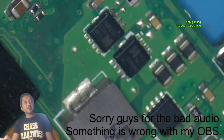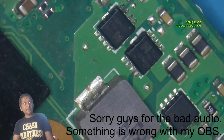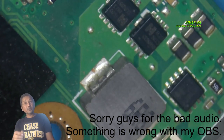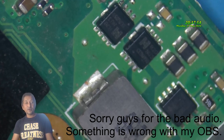They are also N-channel, and I checked, they are nearly similar. According to Sorin, we can use any one of the N-channel. So I will replace that and have a look if the laptop comes on. Okay? So let's do it.